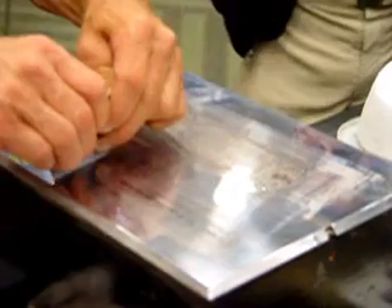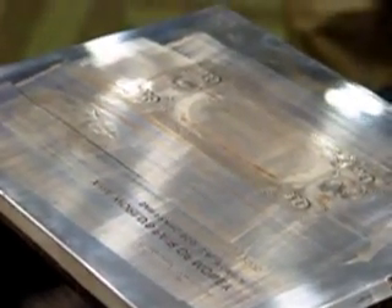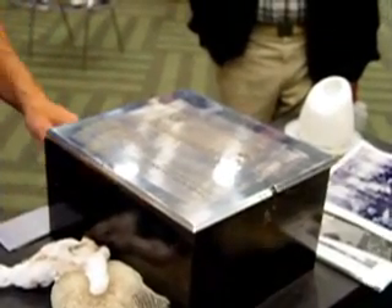What this is, is a piece of what they call rigging board. Regular currency presses have what they call a blanket on top — it's rigging board. That's what actually pushes the paper into the plate. Otherwise you'd have a piece of steel and a plate, and you need something to put a little bit of cushion in it. So they use these boards — they're actually countered boards of 50 thousandths each.